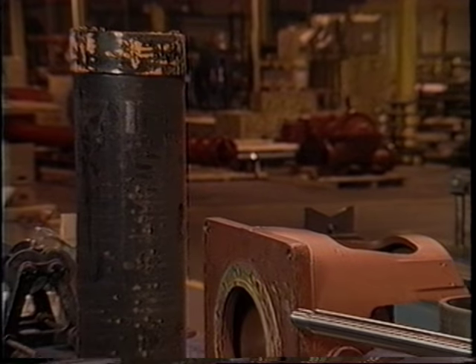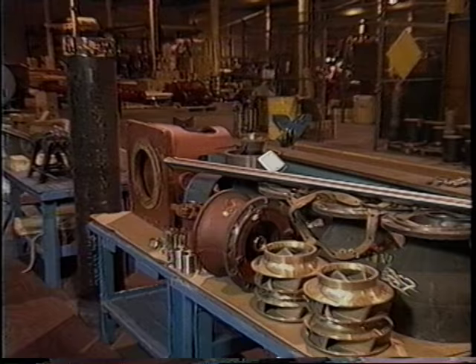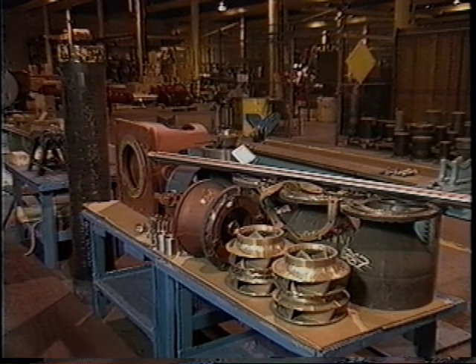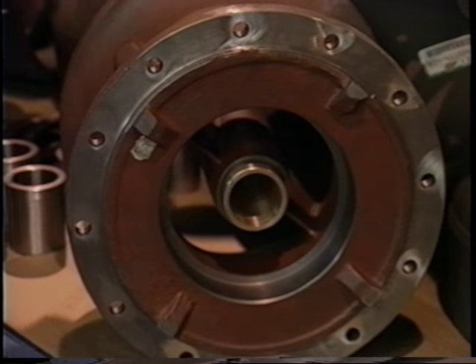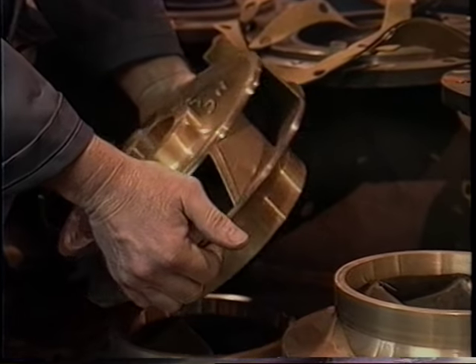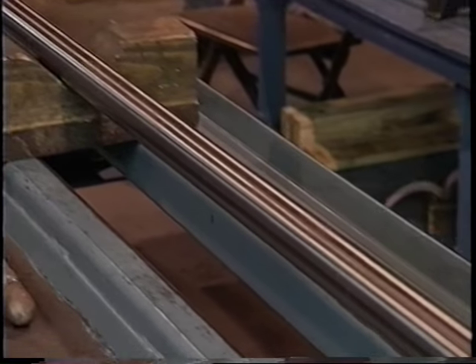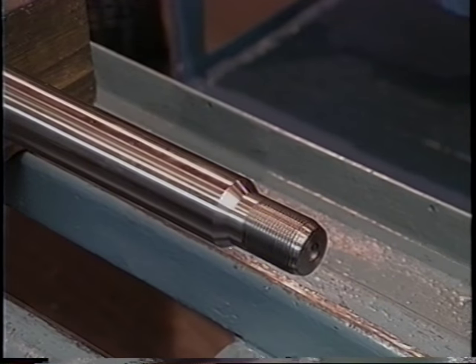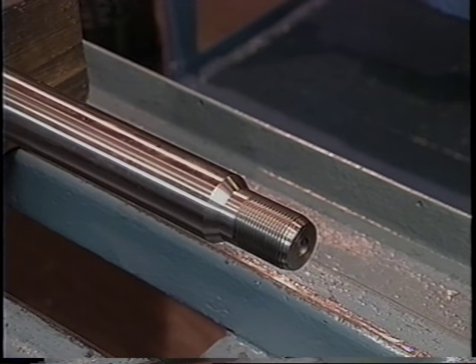The Peerless vertical turbine pump model 14 MCF, four-stage, comes complete with the following parts. Before beginning the assembly, unpack all parts and verify that you have everything you need. One suction manifold — verify that the bearing has been pre-installed. Four impellers — depending on your application, the impellers may vary in size. One impeller shaft, whose diameter may vary according to your pump's horsepower requirements — verify that it is straight and free from burrs at the threads.